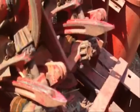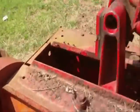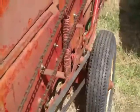All right, now I'm back at 12 o'clock. The needles are tripped, coming in. And see, now you have to look at where the needles are rubbing against your twine holder. This needle really needs to be adjusted down. And this one is way too tight against that one. And that's got way too much play in it, so that needs to be tightened up also. So I know I'm going to have to do some adjustments on that. But I just wanted to show y'all where you adjust them, down there at the base of the needles.